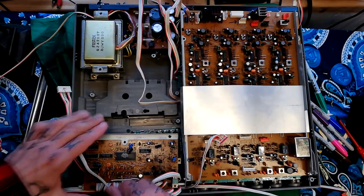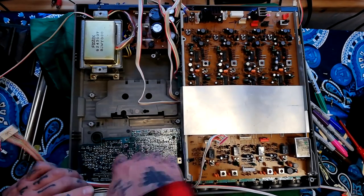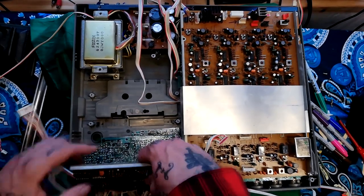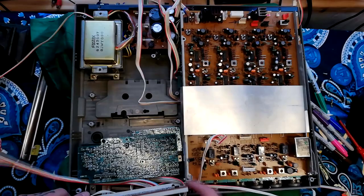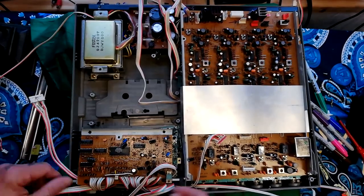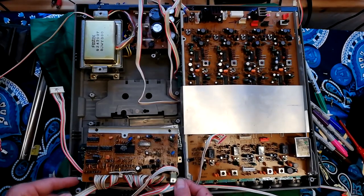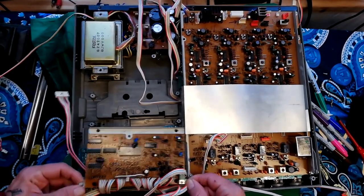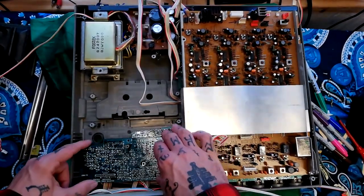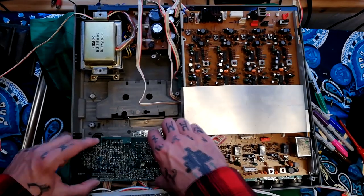This is partially disassembled, but there's a screw here — a wide ferrule that goes into a plastic mounting post that I'm pointing at. That causes this to tip up on a hinge. I've actually removed that, but basically the two pins at the bottom of this board go through two slots here. You push it off to one side and then it'll come out — that's dangling off. Then you're faced with this board. There are three screws holding that in place.